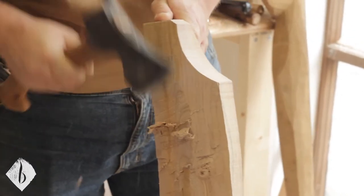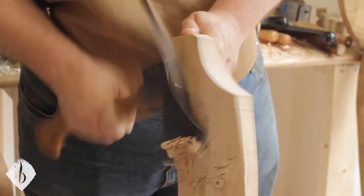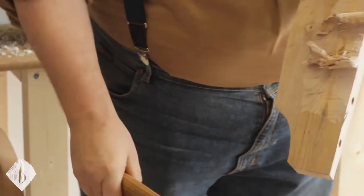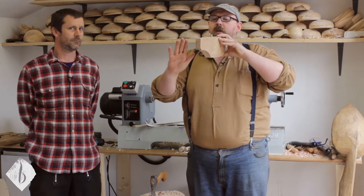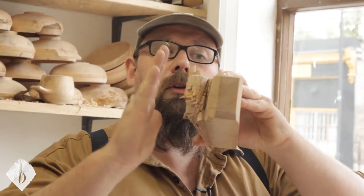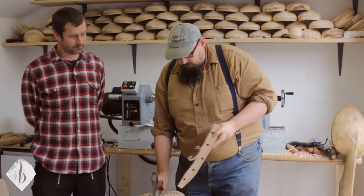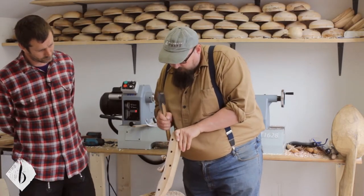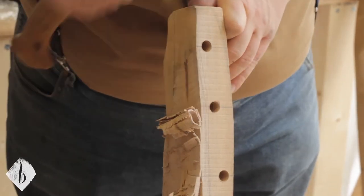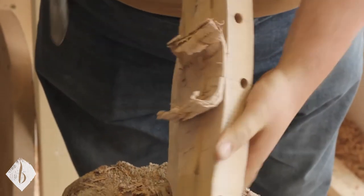If you feel like you drilled your holes pretty wonky, then you maybe need to be a little bit more careful at this point. Just be wary of the angle that this curve is coming in — if you have that angle tilting in, you're more likely to be coming into those drilled holes. I'm trying to come square and if anything just touch this way, just getting this bottom bit set. If you could draw much better curves on, you'd be much better off.